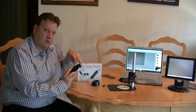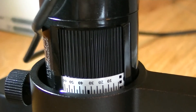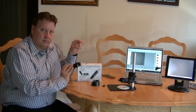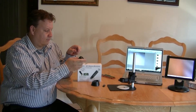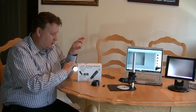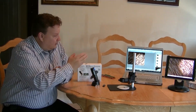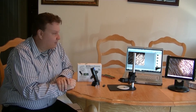Basically, with this microscope, the closer you are, the higher magnification you will receive when you adjust the magnification wheel. These front ends concentrate the light from the emitters on the bottom here onto the subject to have it well lit. The program itself comes with built-in measuring devices so that you can accurately measure components or anything you're trying to measure on the microscopic level.